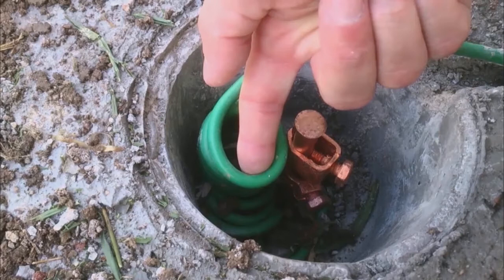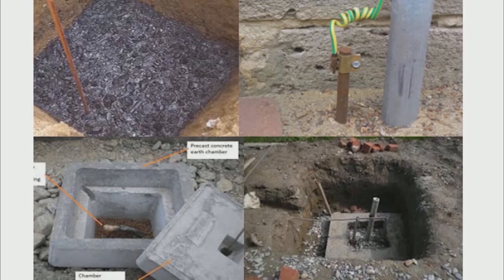Secondly, the space inside is very limited and it is very tough to check and maintain. Therefore, the products used for a gutter aren't technically right for earthing. For example, if you notice railway installations, they would never use such a method as they use the right products and materials. In traditional earthing — whether digging a hole with a rod surrounded by coal and salt, inserting a rod directly in the ground, making a chamber with a rod and wire, or making a brick wall with a rod inside — all these methods, as we can see in the photos, are wrong forms of earthing.